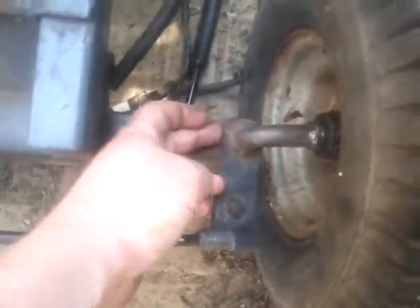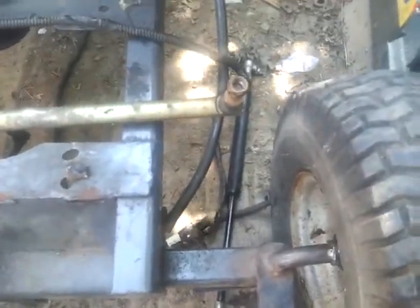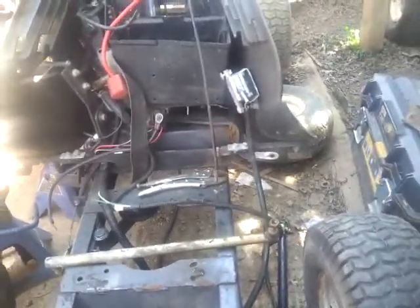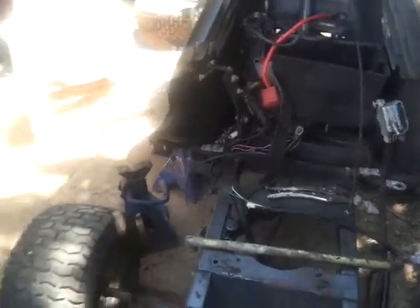Right here you've got no clearance between here and the I-beam — the I-beam front end. So either I have to take it from the bottom and angle it upwards, similar to what the Craftsmans do, or relocate that bracket there to the top side. If I can get the mount into here — the Craftsman one will fit right in there — but again, the bolt's going to be practically touching the ground. I'll angle it up to there, but the less angles you have in there, obviously it will be better. So I'll have to figure out how I'm going to do this and make it work. If anyone has any suggestions, please leave them in the comment section below. I'll talk to everyone later — please keep it redneck like always, and don't get your antlers stuck in your steering wheel. And here is Miss Shania.